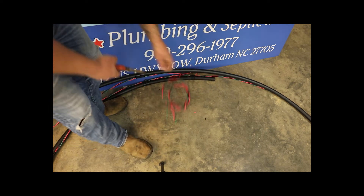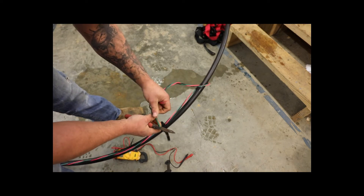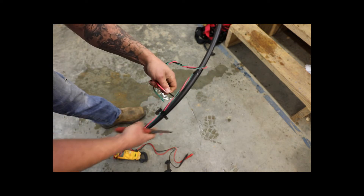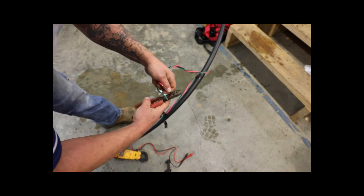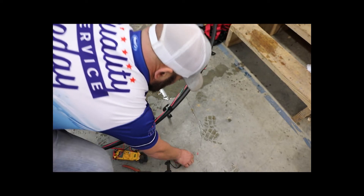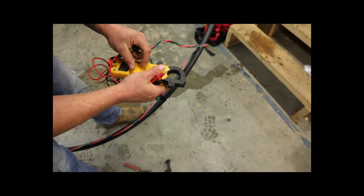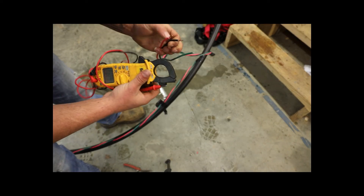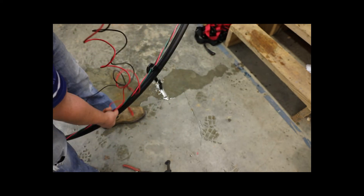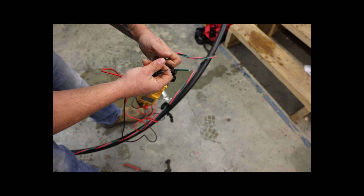What you're going to do is put those together and go back to the pump end. Let's say this is the end we disconnected from the pump. You can do this at either end — you can wire nut it here or you can wire nut it at the head, it doesn't matter. Check continuity before we say the pump's bad or something's wrong with the pump. Always check your meter.